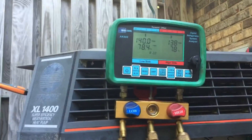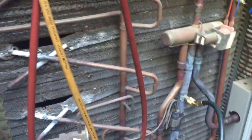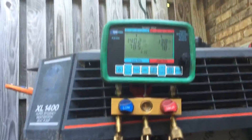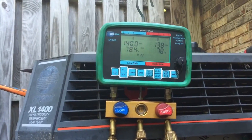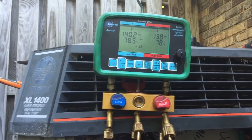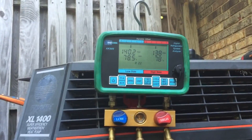This test can be skewed a couple of ways. If you're severely low on refrigerant and this coil does not have enough refrigerant, you won't have enough space inside the condenser to actually skew the saturated temperature enough. So you do want to make sure that you've got enough refrigerant to do this test, especially with a large coil like this old Trane unit has.